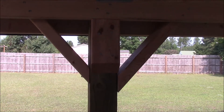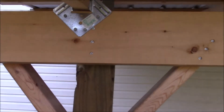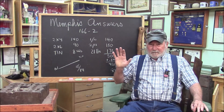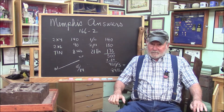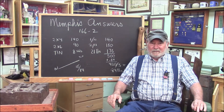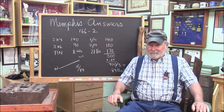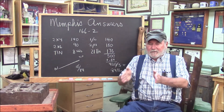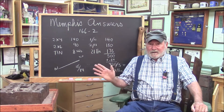This whole arrangement is repeated on the other side. Here we are on the outside and you can see we have the same setup here on the other side. My conclusion is that our shed roof will certainly outlast the one I based it on, which has been in place for 45 years. The joints are plenty strong for 84 pounds — in engineering you can usually double that and then double it again. It will certainly hold up. The idea of putting the braces on top of the post or in notches is a good idea and probably the way you ought to do it, but the way I did it will also work.